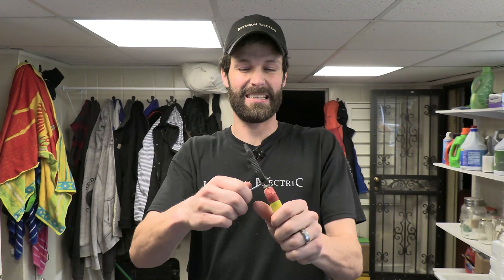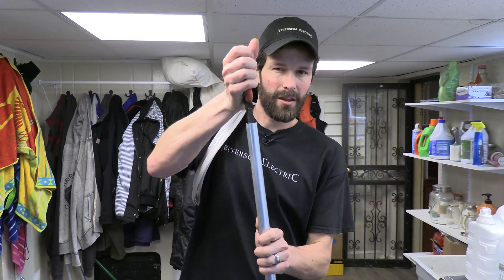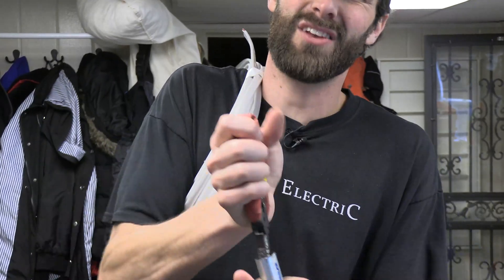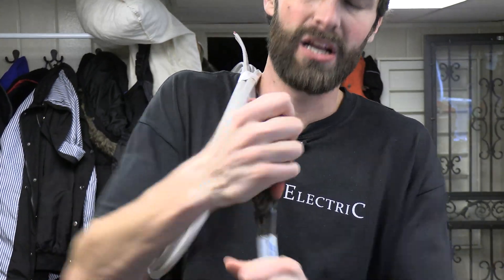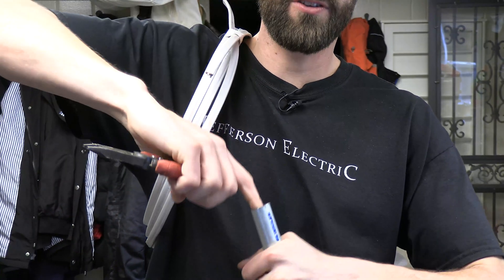I've got a two-inch 6-32 bolt. I've threaded it into the 6-32 hole and I can shear it right off while maintaining the integrity of the threads. Number two — look at that coarse edge on the inside of the conduit. It's going to cut your wire when you insert wire. You jam those reamers in there — there's that rough edge. Slide it around, give it a good clean up, go deeper, ream it out.